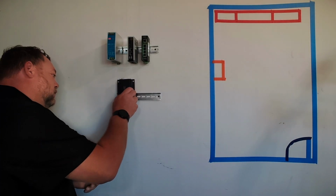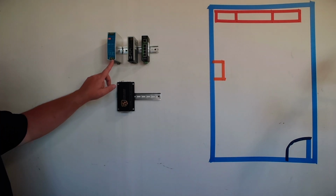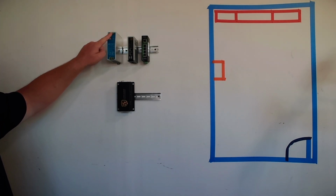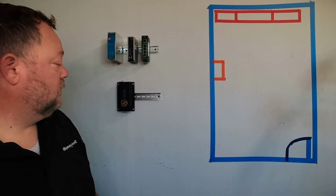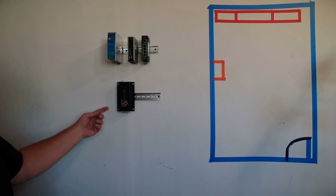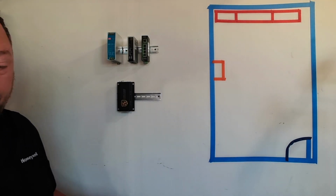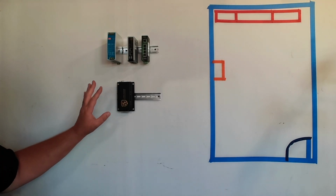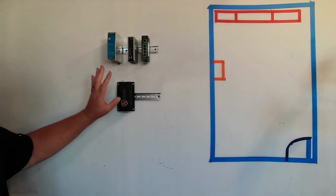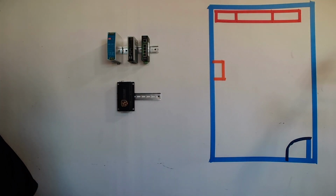I believe it goes just like that. So we're going to pull 12 volts from here, come down. Our chain A is going to come out and hit to our devices. And we have our output here is going to come up and tie to our switch. Now, what we're going to do now is we're going to start putting some of the Cat5 in and we're going to work our way back. Before we do that, actually, let's go ahead and put this together and then we'll tie our chain backwards into it. And then we'll go over the whole entire thing together.